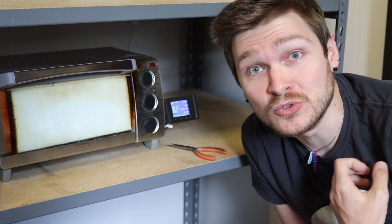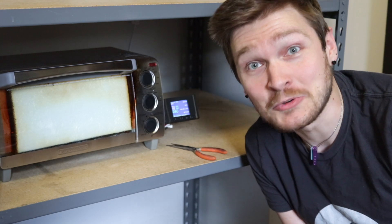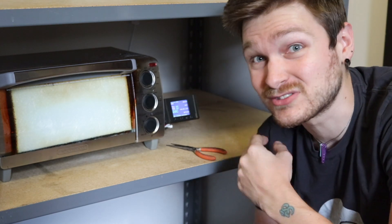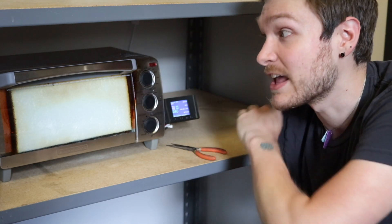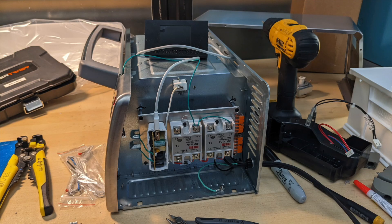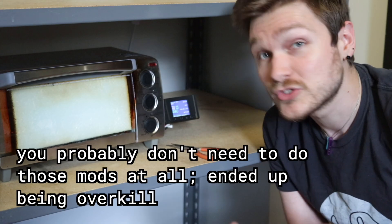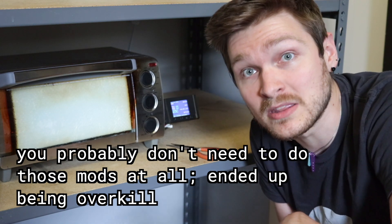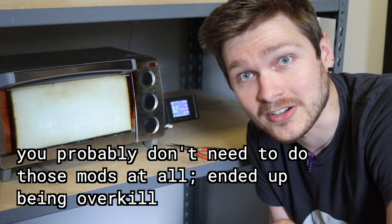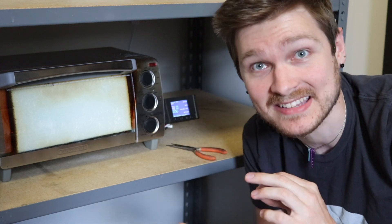In my situation, I wanted to use a Loctite GC10 — that's the paste we use here — and it needs 250 degrees C. So I took two and a half days, ripped the whole oven apart, did a bunch of mains wiring, put all the solid state relays inside the frame, and did a bunch of insulation with RTV silicone and fiberglass so that it could reflow following the profile curve that GC10 requires. This thing is great, it's a workhorse, it works fantastically.